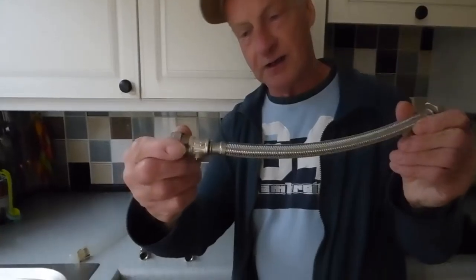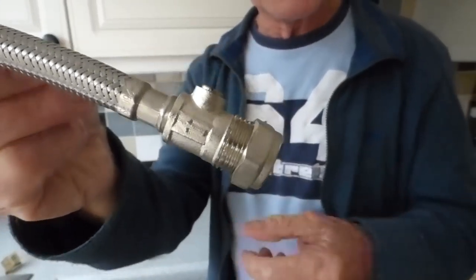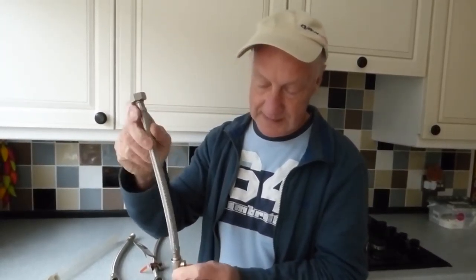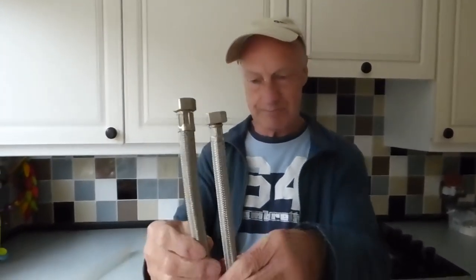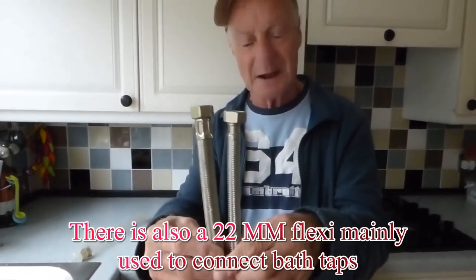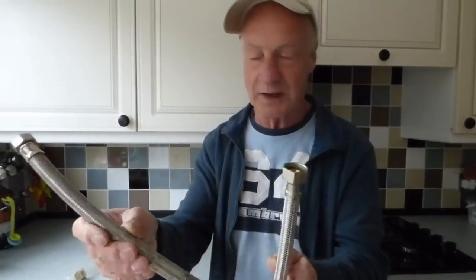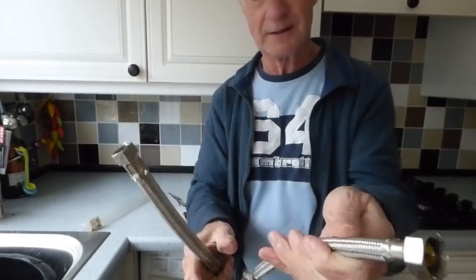Another size you get is a 15mm short one with a valve on it — like so. You can see it's got an arrow showing the direction of the feed. This is a very useful one: it goes on the pipe and up to a valve on a toilet system, and it means you can turn the water off just by turning that valve with a screwdriver — you don't have to turn the whole mains off. They come in different sizes too. Here's another one that's quite a lot thicker on the outside, but the internal measurement — what we count on — is still 15mm. It also has a valve on it; it's just made thicker and not as flexible.